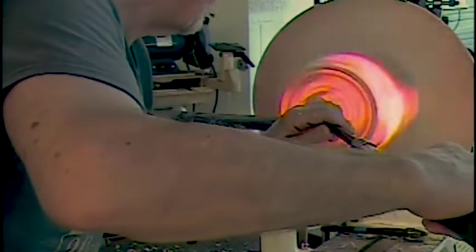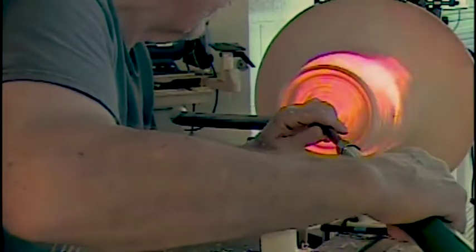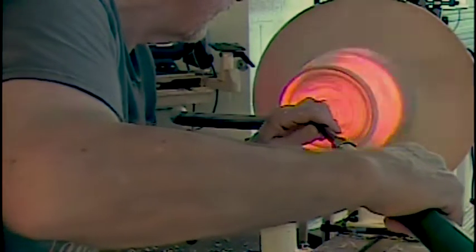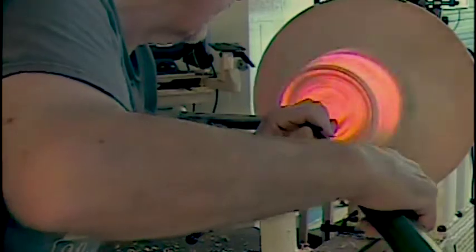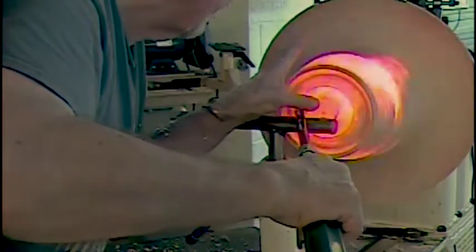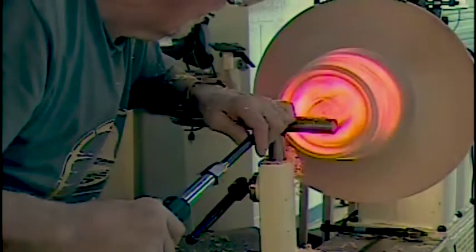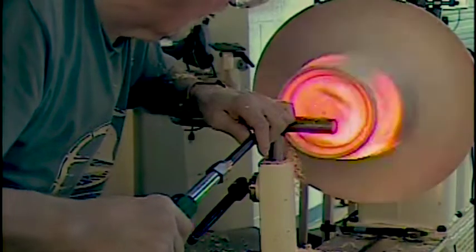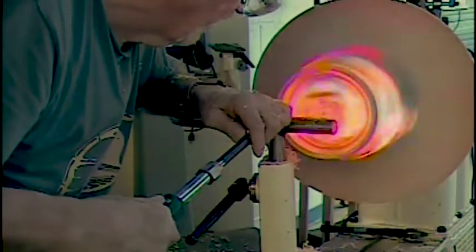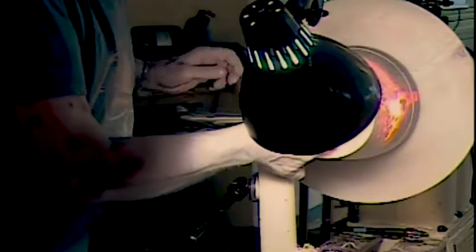And if it's pretty thin, it can sometimes chatter. The wood is so flexible, it wants to chatter. It makes a harmonic spiral. Get anything like that going, you put your thumb on it like that, then it won't chatter. Right there in the bottom of the belly, it's pure side grain, so you gotta leave that a little bit dark. You don't want that as bright as the rest. Something like that. That's ideal.